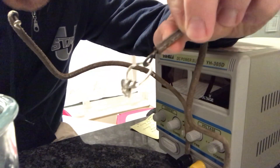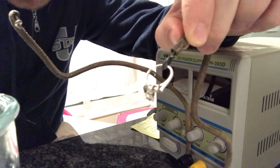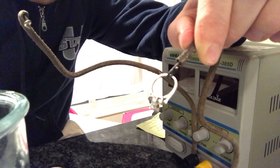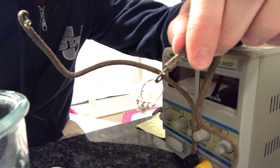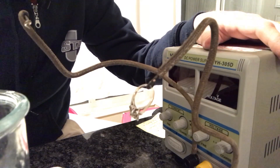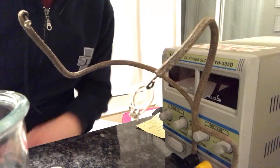The best anode, if you can get it, is platinum. Here, I'll show you — this is my wife's ring that I gave her. I'm obviously borrowing it back right now. It is a platinum ring, and I can use it as an anode and it will remain platinum — nothing will happen to it. This is my direct current power supply. It's pretty nice because I can adjust the voltage up and down, and I'll show you that in just a sec.